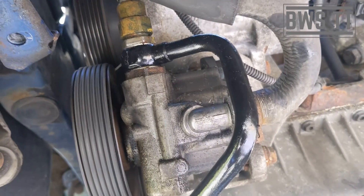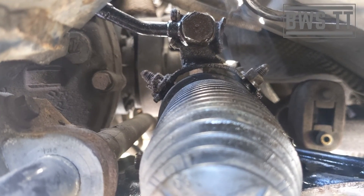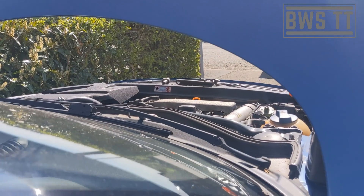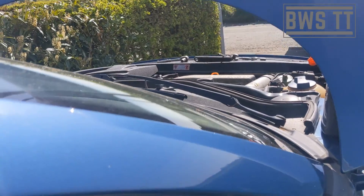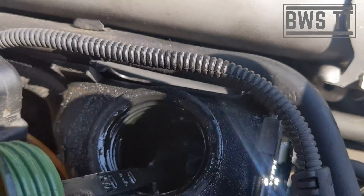Looks spot on to me. Straight off the back there's no noise of air in the system, which looks fine. I'm going to go left to right to full lock — there was a slight bit of noise at full lock there, only a slight bit. Now looking at the fluid in the tank, there's a little bit of froth, just a little bit, but not very much at all. That is why we pre-fill it by hand — otherwise it just takes ages.